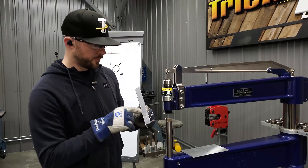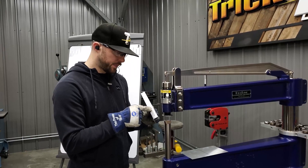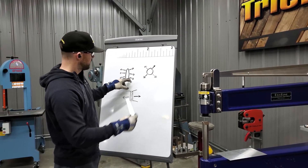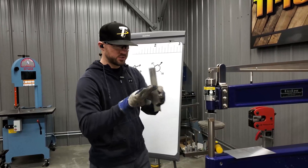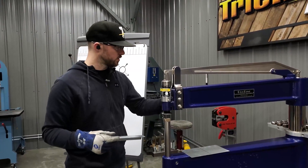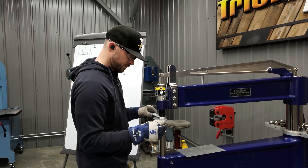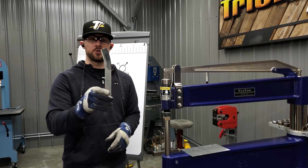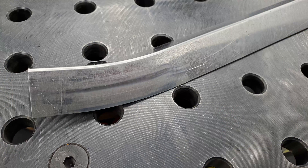That was just a little bit to show what it's doing. The contact area is actually wider because of that shape, and as it hammers down through there you get all these lines next to each other doing that stretching motion. Turning it up a little bit to make it work faster — you can see just with that you get a bit of curve in that flange, doing a similar action to a shrinker/stretcher type machine on the stretcher jaws.